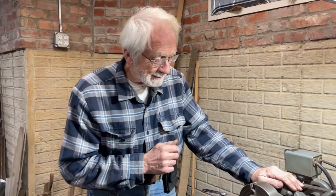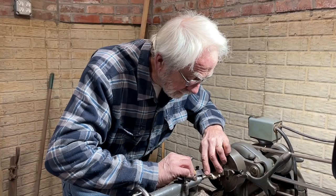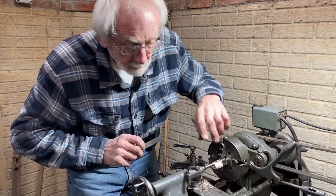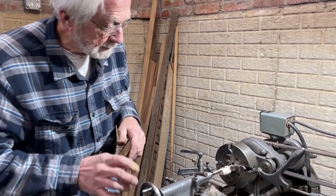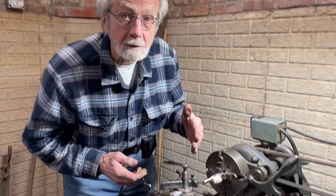Okay, so you're saying the shorter one would be 1 1/8 and let's say 1 1/4. One and a quarter. Well, so how long do we have there? Currently it's all the way out to 1 9/16. So for 1 1/4, we could just do 1 1/2. Just barely knock off my center hole there. Even if the center hole's on there, it won't really matter. Some of the center hole left. But just so long as, if you put that 30 degrees on there. First, I don't think it has to be. Knock about an eighth of an inch off of there, and then we can come back and bevel it.